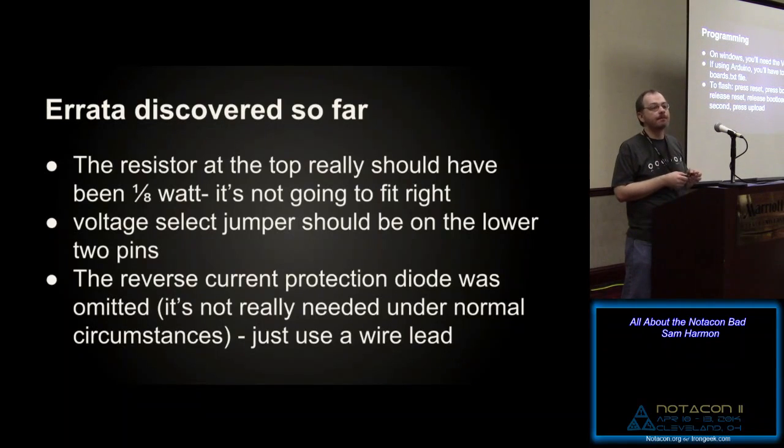What are the 3 parts that are inside the center of the chip? Those are actually capacitors. They're the 2 capacitors for the crystal, and those are like 27 pF, and then there's a 0.1 microfarad just power regulation cap. You could put them in that way, but usually they're just covered up by the socket. So you just solder them in, then you put the socket on, and that covers them up pretty nicely.